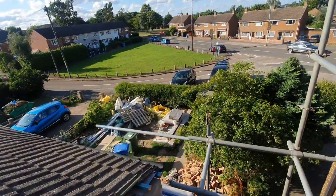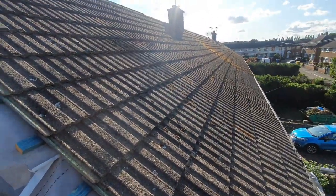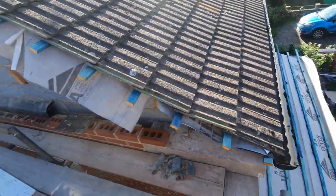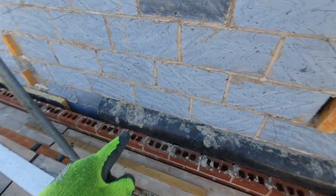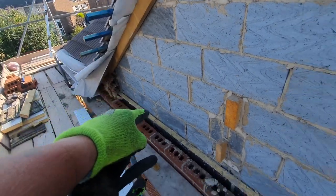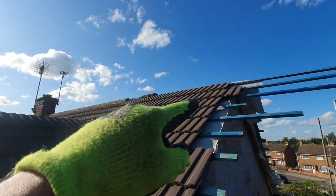Shall we have a look at the front? What I've managed to do is take all of the roof tiles — the old tiles from the back — and use them on the front, so it looks completely matching and you can't tell the difference. We've still got a tile on the porch down there, but we're almost there. There's a cavity tray over the bathroom window. The building inspector's not seeing that, so it's a good job I've got it on video. You can see we've got loft insulation poking through meeting up with our Kingspan insulation, so it's a continuous layer of insulation all the way through and around the house. Just got a few ridge tiles to put on along here.